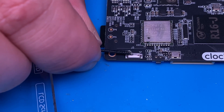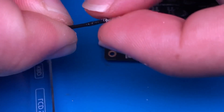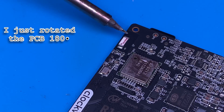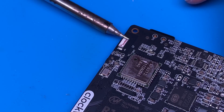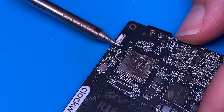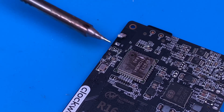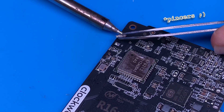The tip of the antenna goes to the left pad and the insulation to the right. To remove the antenna, I first heat up the soldering iron to 300 degrees. I approach from this side to avoid touching any components accidentally. I touch each side for a few seconds to heat both pads up — going left and right. They get soft and if you just push it from the side it easily lifts up. I can use the pliers to hold it — and it's gone.